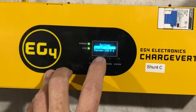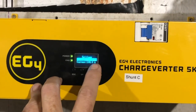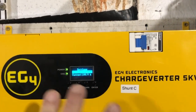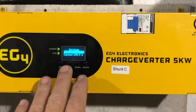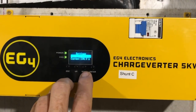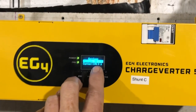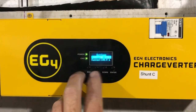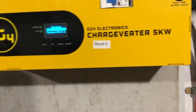There are only two settings you have to be concerned about. The voltage — it comes default at 48 volts but you'll adjust that using the settings since every system may be a little different. And the amperage: 100 amps is its max. You can take it down if you have a smaller generator; I typically use the full 100 amps.